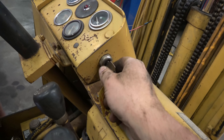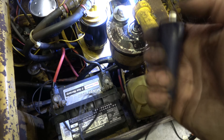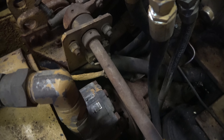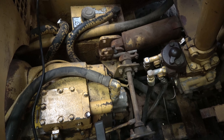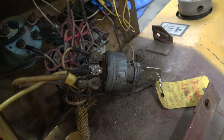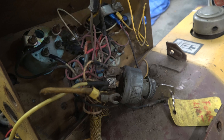We got another problem here — it doesn't always want to start with the key. But I got a start switch hooked right up to the starter. It cranks over, and I'm tracing that wire to the S-terminal back. It goes to what looks like a safety switch on the hydrostatic drive. I think we're going to take that off and jumper it. We ran a jumper across that — that didn't do it. Tested voltage: we're getting 7 volts there, and we're getting a 3-volt voltage drop at the switch.